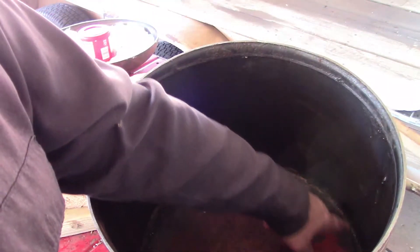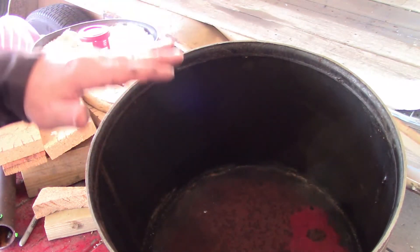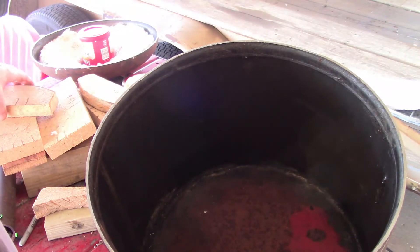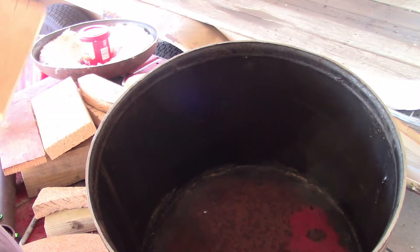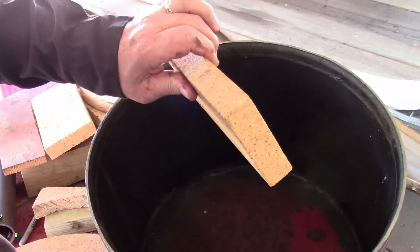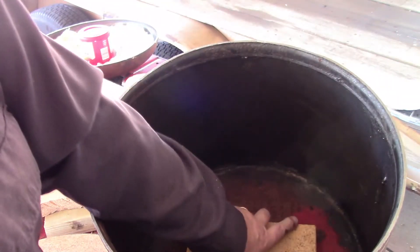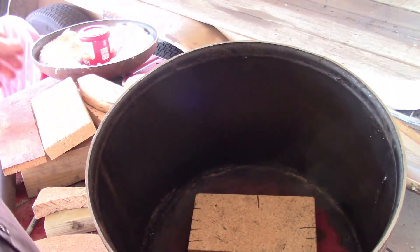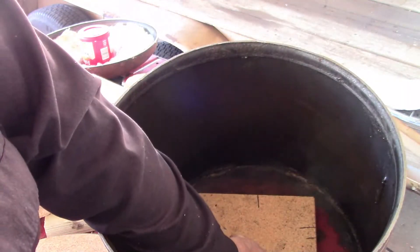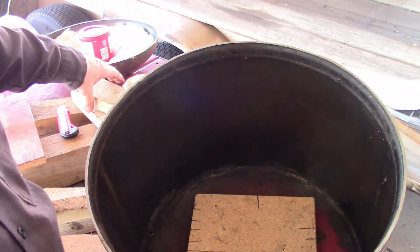You can see that I welded a bottom in this — the original dome lid and then a bottom. I have a bunch of these fire bricks, about an inch and a half roughly, and I put them in there. I'm going to line the bottom with these and then put some more of that refractory cement in there.